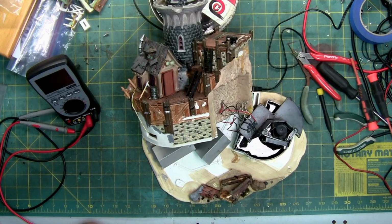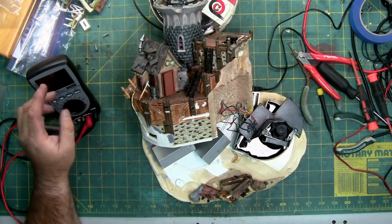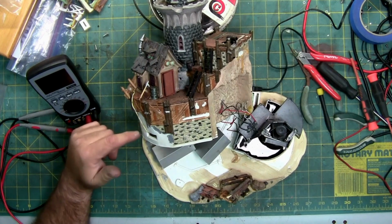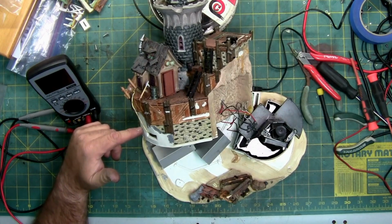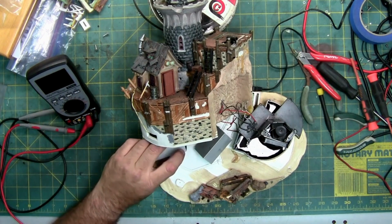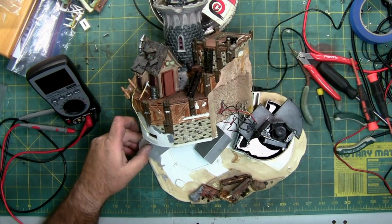And then I'm going to do what I've done on a few other ones, which makes them long and boring. I'm going to give it power. I'm going to test where all the power sources are. Then I'm going to turn them off and test the resistance and capacitance levels of all the components to see if something is so far out of tolerance or if it's popped, meaning it's open and no longer a viable component.